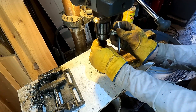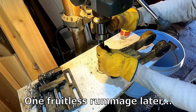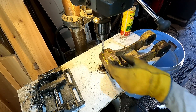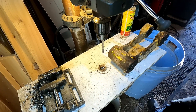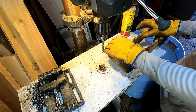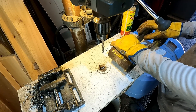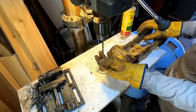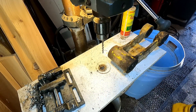I think my drill bit's bent — that's sort of a problem. That was a 9/32 drill bit that I wanted to use. Unfortunately I don't have another one. I've got lots of duplicates under quarter-inch and commonly used duplicates up to half-inch, but that's not a commonly used one. The point here is to tap an M8 by 1 hole, which needs a 7mm pilot. 9/32 is 7.1mm, which would have been preferable. The next one I have is 17/64, which is about 6.8mm — I think I can make that work.